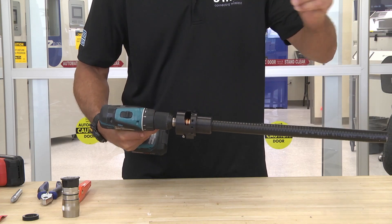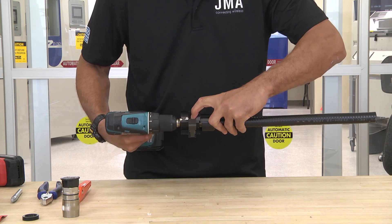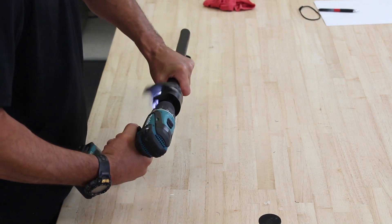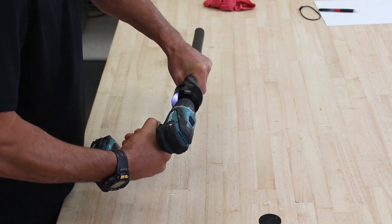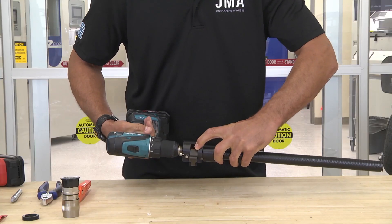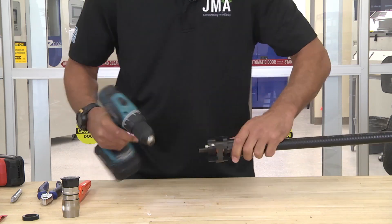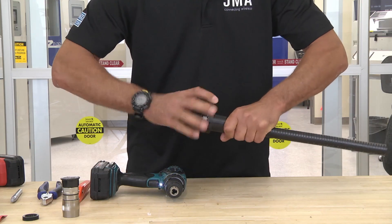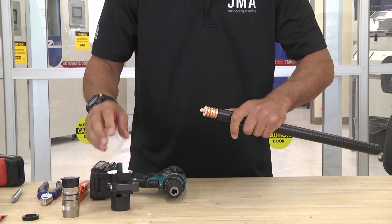Once I strip the jacket, I want to make sure I look in the window to see that the right blade is on the peak and the left blade is in the valley. I take my blade, release the pin, and go one direction. I reverse it and go in another direction. If that blade isn't flush to the bottom of the cable, then you know it's not all the way through. You can simply remove the tool, put your hand on the guillotine cutter, and rotate the tool until it is flush. Then you remove the SP 7/8 FX prep tool.